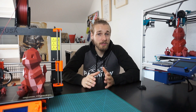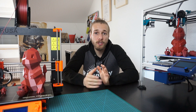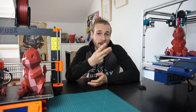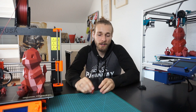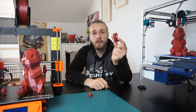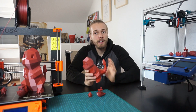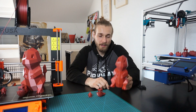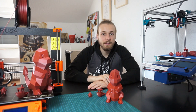For this I used Cura 2.6. I didn't use Prusa Control, Prusa Slicer, or Slic3r. I used three models: the Little Marvin from 3D Hubs printed at 0.1mm layer height, the classic Benchy at 0.2mm, and finally a maximum-scaled Charmander — 325% on the Hypercube and 375% on the Prusa.